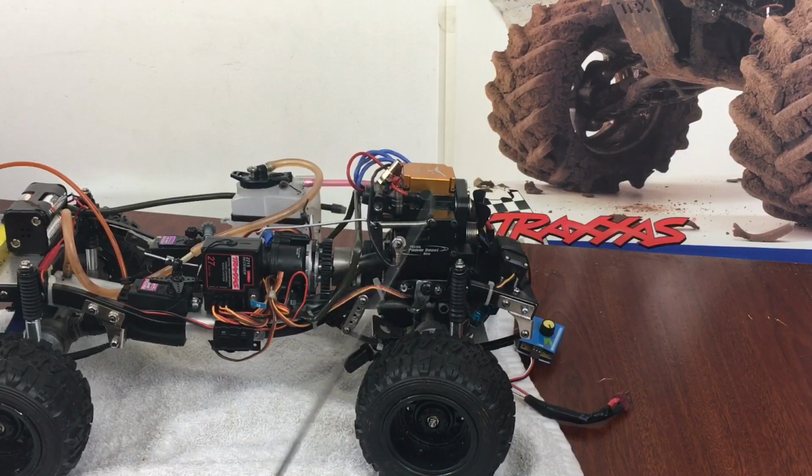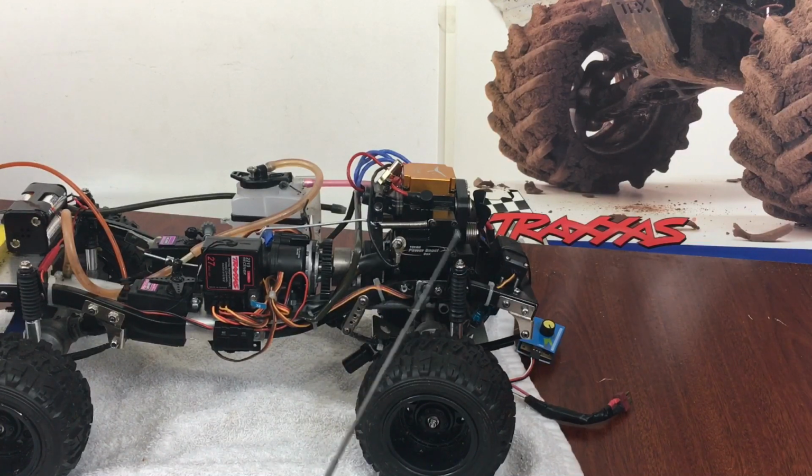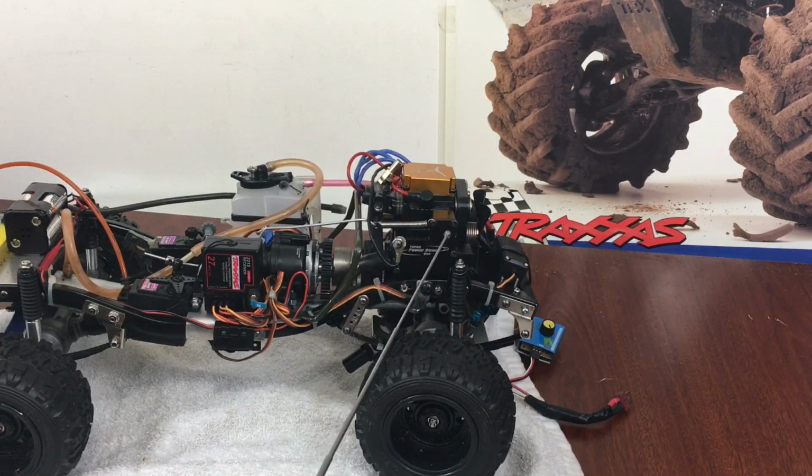So me, I can't leave well enough alone, so I took this thing right off, because I'm seeing this as complications. Two strokes, you need some kind of an echo system to bring the charge back into the cylinder, where four strokes really don't. They got a valve for that. But when I took it off, the performance of this motor jumped right up quite a bit, actually. I was really impressed with it, but it was loud as hell.